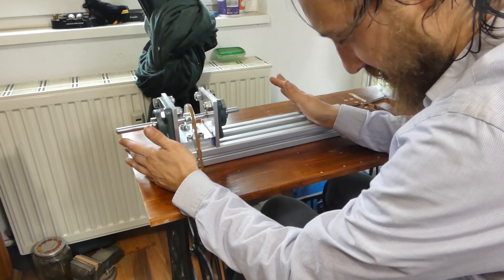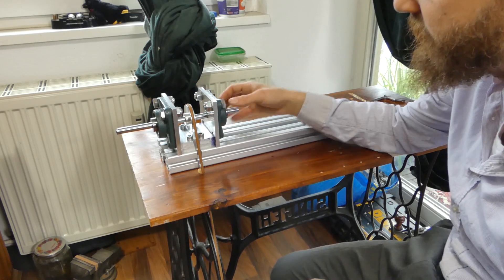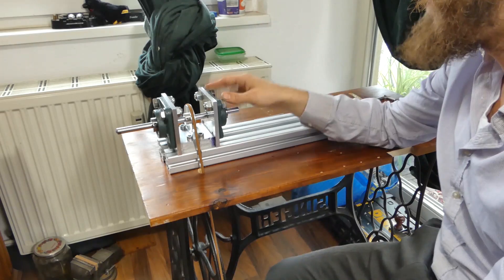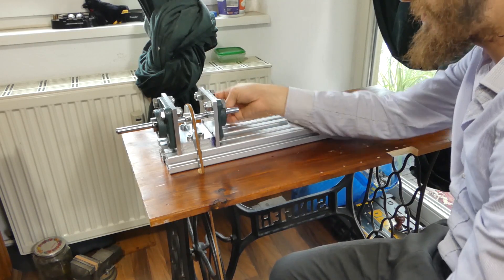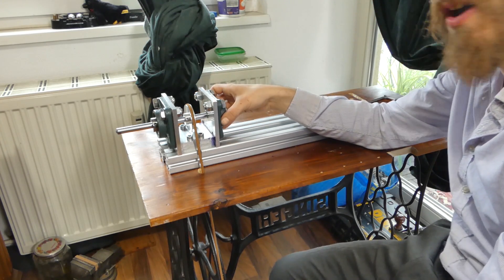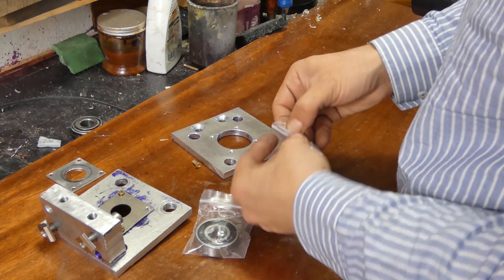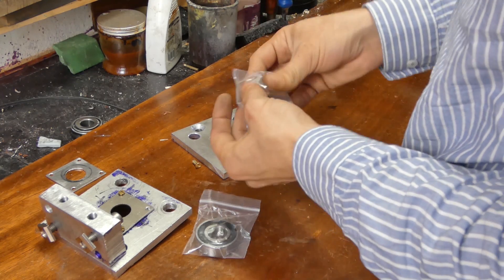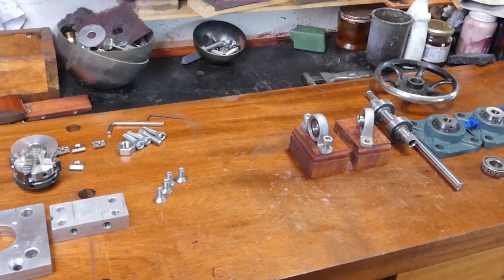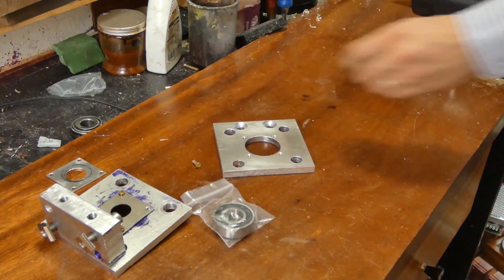It looks fine, but I feel like there's a lot of friction. The bearing housings — these two green overkill blobs — I didn't read closely enough, but I have the feeling they're meant more for rigidity rather than smoothness and speed. So I decided to discard those bearings; they're not going to fit for my lathe. I apologize for any continuity issues in the video because I went through a lot of versions and iterations. Finally, I found a spindle from a real lathe online, really cheap.